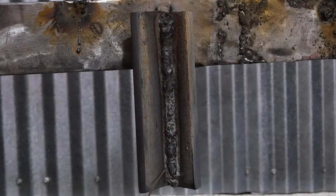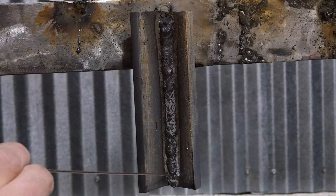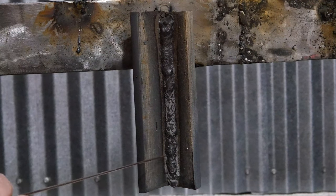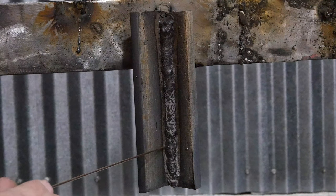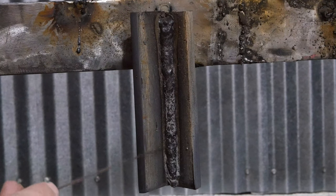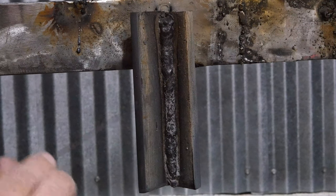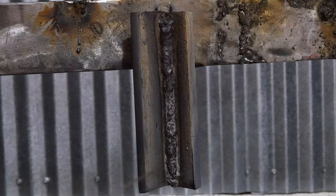There's our stringer bead with the NR555. I had a slight downward angle on my electrode, and I just went from point A to point B. But since this wire has so much more nickel in it, it left a very convex bead — it's a pretty small bead in general. I would like to see it flatten out a little bit. I called the Lincoln engineers, and they said this wire was okay to give a slight back and forth weave width to try to flatten it out.